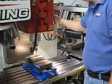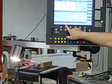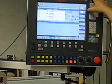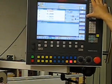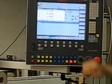There are a couple different things I can do when finding a zero. If you look up on the screen — and I know it's going to be a little hard to see — I can select the Work Point Zero option. When you go to Work Point Zero, I have the ability to find an edge using the probe as an edge finder. I can find the edge with multiple points; if my part happens to be skewed at some angle, it'll compensate for it. I can find the inside of hole features or the outside of boss features. In this case, we're finding the outside of a part.